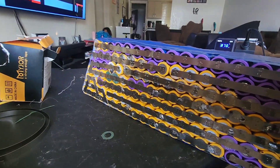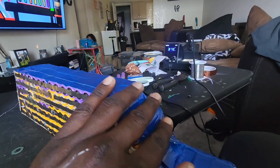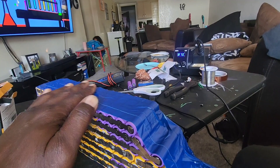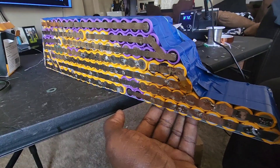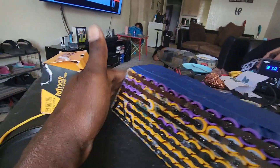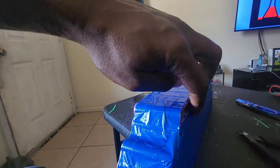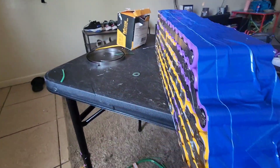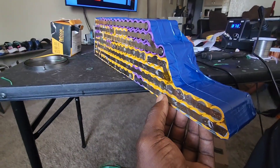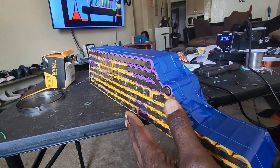It's a very hard, complex process but I managed to get it done. We're going to be roughing all this stuff up because I want to put cardboard over here, glue the cardboard onto the batteries, and then have velcro on the bottom so it'll go on the down tube. I'm going to run my lead - it's going to come right here and come down with the positive, and I have protective tape over all this stuff so I don't get any shorts.